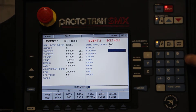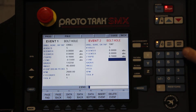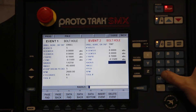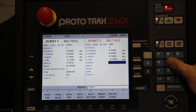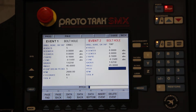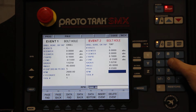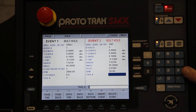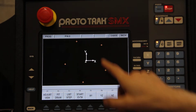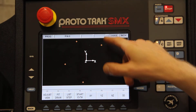So 5 holes. Center is zero zero. Rapid to 100 thou. Ending at 0.55 negative. The radius is 1.625. Angle of the first hole, 45 degrees. Now the pitch — say for instance if we're doing 20 TPI, 1 divided by 20 gives us a pitch of 0.05. RPM, let's slow it right down — I'll say 50 RPM for example's sake. And this time our tap will be tool number 2. When we take a look, the plus now has a little circle around it showing that we've drilled and tapped the hole.